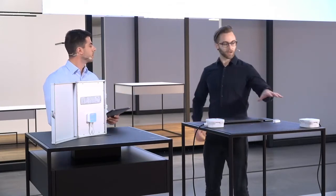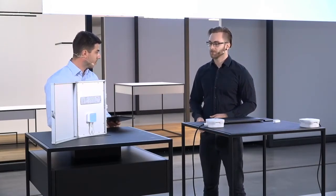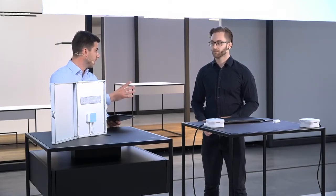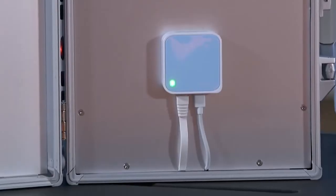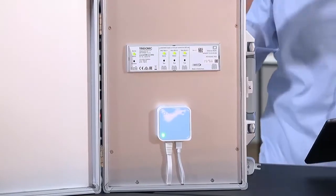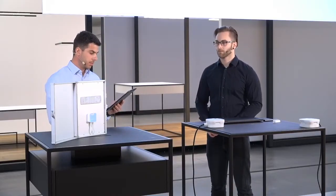In our case we have a pure emergency wireless system, so on the basic dim wireless side that's it — only those few clicks to establish a wireless emergency system connected to a SceneCom controller. Now we'll configure the SceneCom controller. We have a router connected to the Ethernet cable from the SceneCom controller, which enables the Ethernet connection over Wi-Fi. I can access the SceneCom controller just by using a browser.